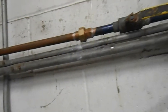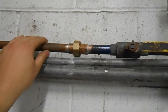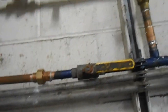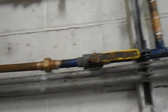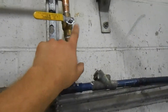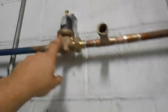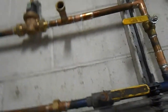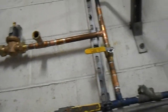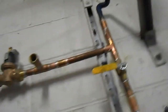These valves are completely useless now — they're just inline. We have a new union here. The old pressure regulator failed, and that was causing us trouble with the new plastic pipe we just welded because it was putting city pressure through. This ball valve was leaking by, so we replaced that, took this whole thing down, coupled it here, and put this T in. Here's our new pressure regulator. We put a union here so we can take it apart, and this is a city pressure bypass so we can fill the loop fast.